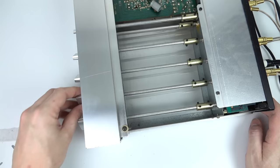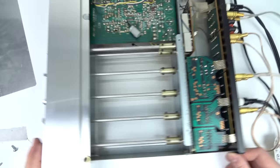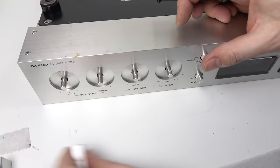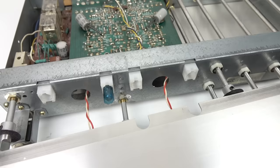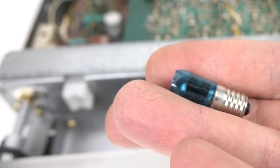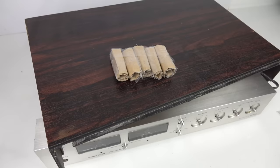Having a look inside here, you can see it's a pretty simple machine. We've got the switches that operate the different selectors at the back - purely mechanical. You can go between the different sources when the power is off. The power just operates those VU meters and the bulbs that we're trying to get to now. So I'm going to take the switches off the front of this, which will enable me to slide the front of the machine apart. It's all made out of quite strong, heavy metal - good quality construction definitely. Luckily there's one bulb left in there. I don't know what happened to the other ones - there's supposed to be four bulbs there. I'll unscrew that, which enables me to find out which type of bulb I need to buy to replace it.